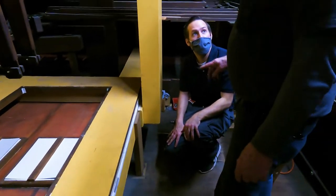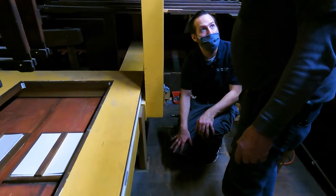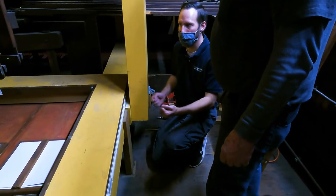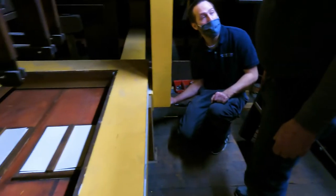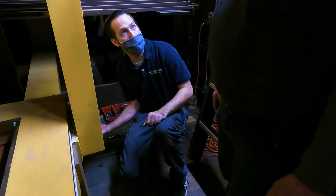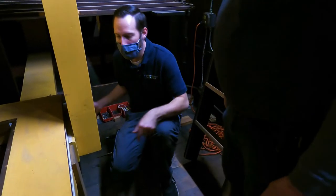Well, I can make it go down lower if you want. And if we need to, I don't think these are screwed to the floor, so we'll actually be able to move the box. And that's the other thing, once we take that away, if we need to pull it forward to get in there to do gasketing and stuff, we've got that option. But what I would want to do is build a little leg with a cleat underneath of it that we don't screw to the box, but just prop under there. Yes, doing something like that would be a good safety.